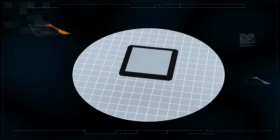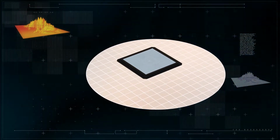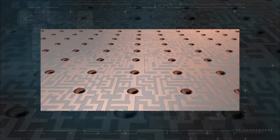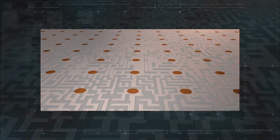Photolithography is used to pattern the first via. Then the pattern is etched. The resulting via features are filled with copper and planarized again to create a standoff from the bond pads on the wafer to the subsequent routing and bond layers.